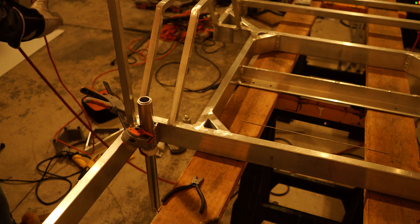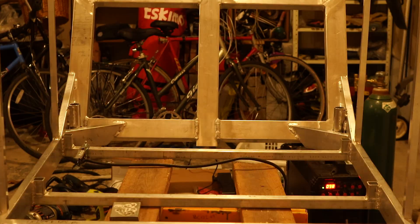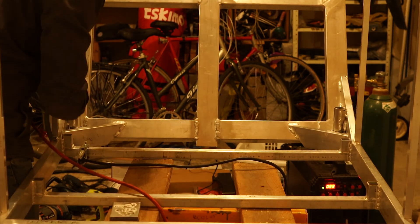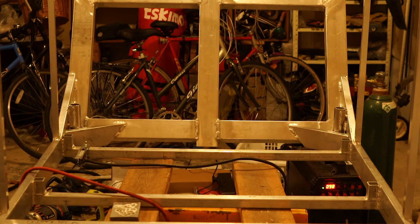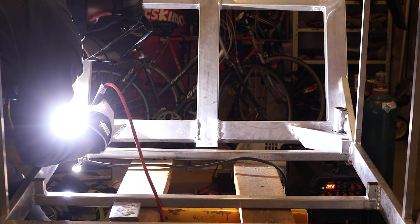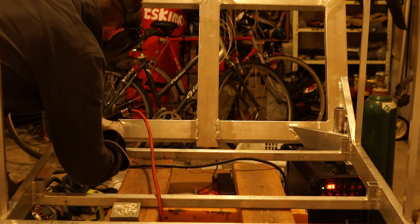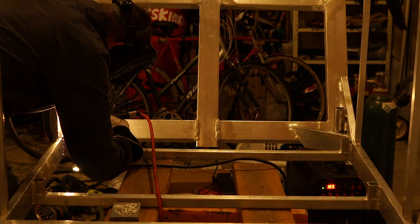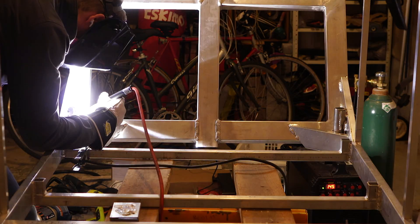The bottom two inches are machined down to a thinness that allows the material to be clamped around the drop-down leg — machined down to probably a sixteenth of an inch — then I cut four slots in the material. I'm using 3D printed tube clamps designed in SketchUp and printed by a local guy, and I'm clamping those tube rings with a seat tube quick-release lever from Amazon. The 8-inch receiving tube gives more support to the drop-down leg when extended, and it allows me to weld the tube to the flat face of the joint going diagonally from the mainframe bed up to the front frame assembly.